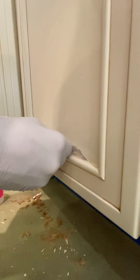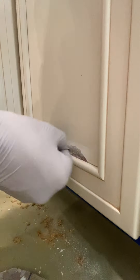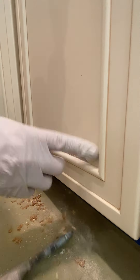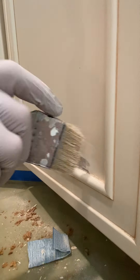My goal here is just to make this as smooth, flush, and level as possible. You'll notice I'm going back around adding more glue and sanding, then more glue and sanding. That's because as you sand, you sand off that layer of glue, exposing more raw MDF — and we really need it covered with glue to keep it hard, otherwise it's just not sandable. After a few rounds of doing that, I get it to the point where I'm pretty happy with it.